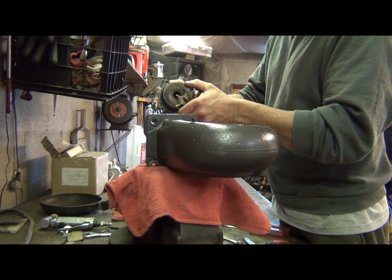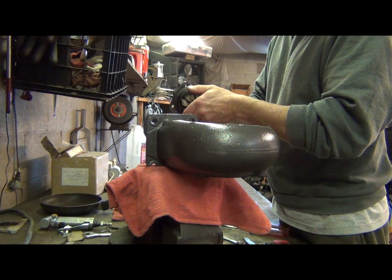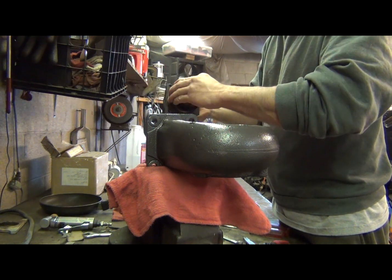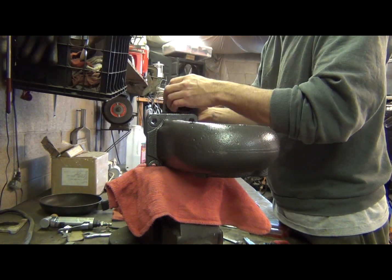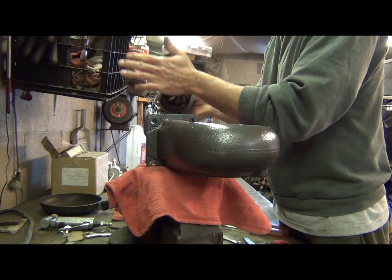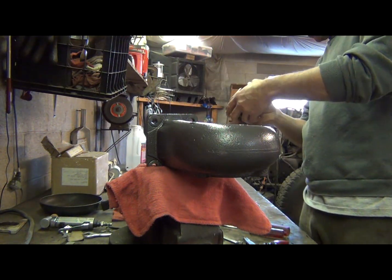As you can see, I already got my bushings and everything on. What you do is you put this just like that, and that tension ring has to go into a bore — that's why I lubed that up. You want to be gentle. It popped in. You want to be gentle so that tension ring snaps in that bore, but you don't want to force it too hard and break it.